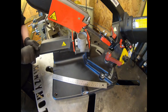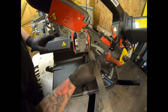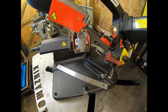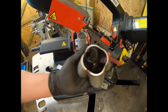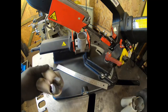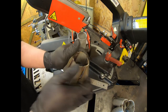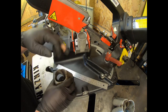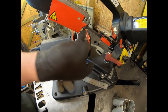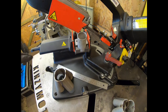Tighten this up. Now, because this isn't going to be a square, how this one came out, it needs to be more rectangle like that one to suit the flange. You need these to be paired, so you'll have one pair, two pairs, because if you cut them all this one first, then moved it and done the next one, they'd be one-sided, if that makes sense. You'll see what I mean when I get cutting.